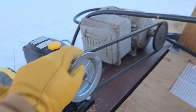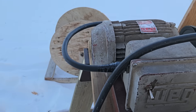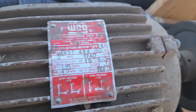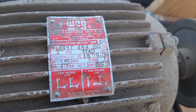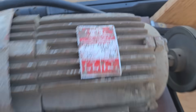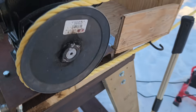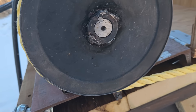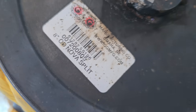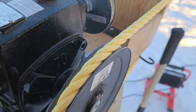The motor was a garage-sale find — cheap, but obviously not free if you're buying new. This is two horsepower, essentially 1800 RPM (1740). So if you go with a 1800 RPM motor and a 10-to-one reducer, and this is an eight-inch steel sheave — it's just a V-belt sheave.